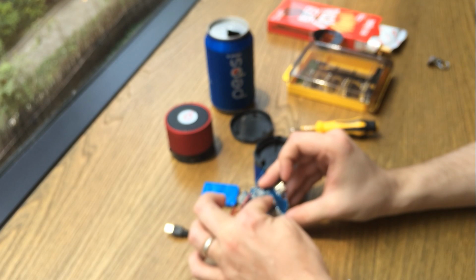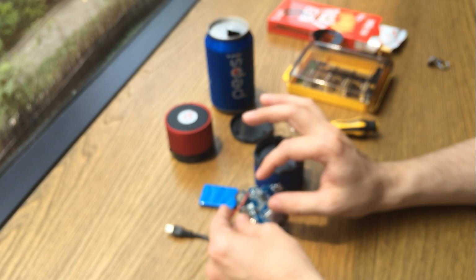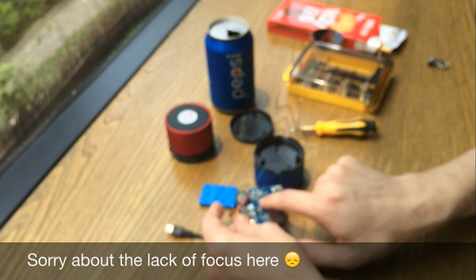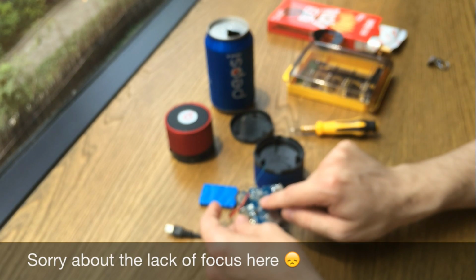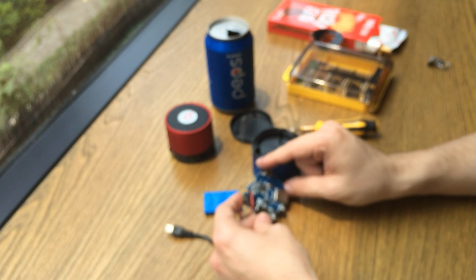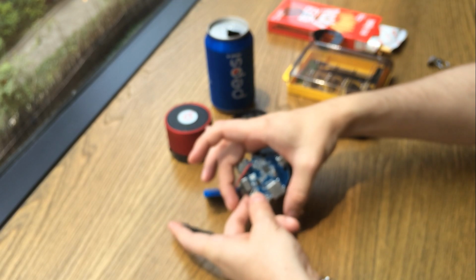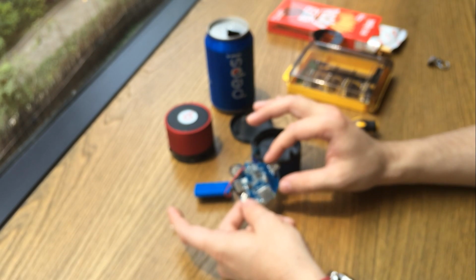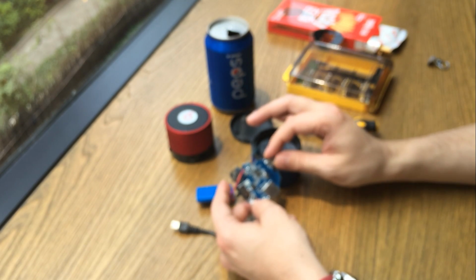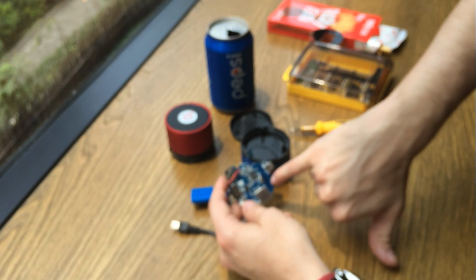So what I'm gonna do is look at the data sheet for that and see what's what. I am a little disappointed. It's not one of those typical little stamp things with a bunch of pads on the outside soldered down. It looks like they've purchased a made for this application system on a chip here, and then just dropped it in to their board. The PCB layout is somewhat cylindrical. It's bigger than I was hoping it would be for my other application of shoehorning this into that speaker case. So we'll see. There's a little antenna there for Bluetooth.